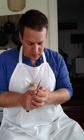And actually, here's a good point. I think it's human tendency, if you find yourself making a cut in the wrong direction with the grain, to try and resolve that cut anyways, right? You're like, oh shit, it's diving in, and you keep pushing the cut thinking you're going to see what the damage is at the end of it. I think that's a mistake. If you notice that you are going in the wrong direction in the grain, you can stop yourself even without resolving the cut and then come back from the other direction.